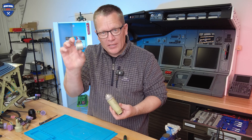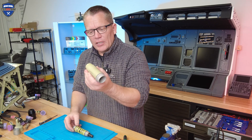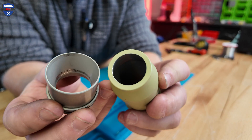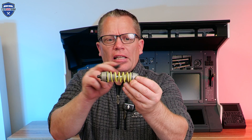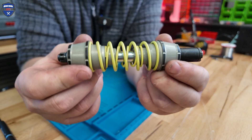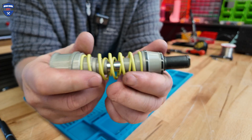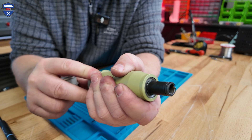With the eye end removed, we can now take off the dust cap. Then we've got a chamfered spacer and a sliding spacer on the outside, and all that does is make sure there's no play in the spring assembly. Off comes the chamfered spacer and sliding spacer. There's the main body — just like the sliding ferrule, they've both got chamfered spacers at each end, and those chamfered ferrules at either end are allowed to slide on this rod completely both ways, fitting into the chamfered spacer and acting against each end.